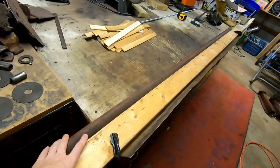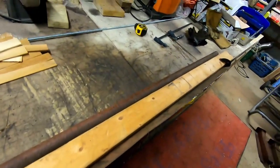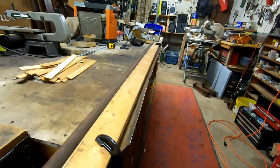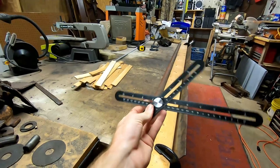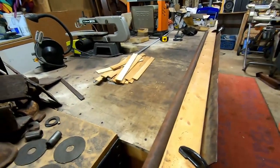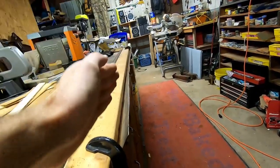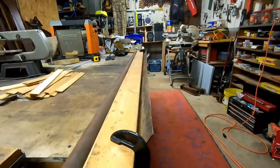Now that we have the big piece cut off, I've got it strapped down like this so we can keep this back bit as flat as possible. I'm going to try to match the angle of this side all the way down — use this as a makeshift protractor, remove these and just get a general measurement to try to get as close as possible. Right now you can see the far end of it has bent down more, so I think we'll be able to get it pretty close and then just fine-tune it from there.